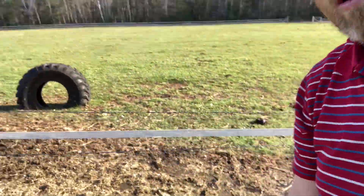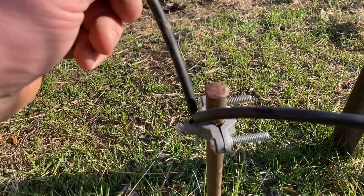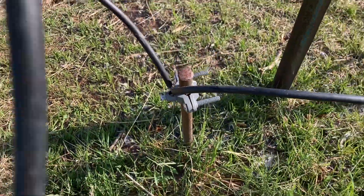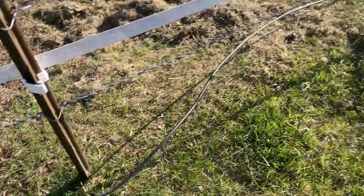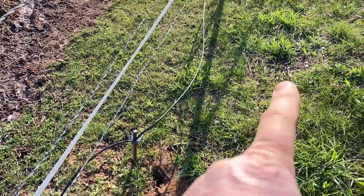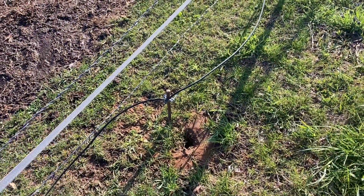Also make sure that your connections are tight — this one's kind of loose so I'm going to tighten this up. Now that the ground is going to be softer, I'm actually going to pound these in farther. I can get another foot in the ground on all of these — they're eight-foot leads, they say you can do six but I did eight. I can get another 12 inches in the ground and get more conductivity with the soil and moisture.